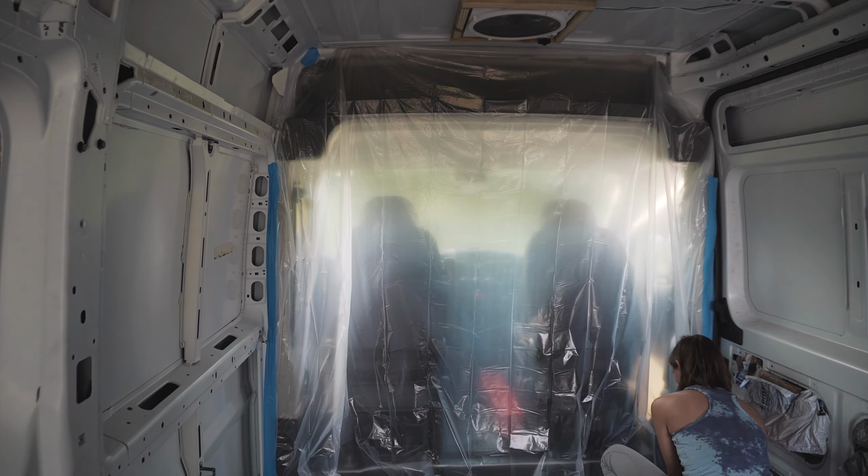Also, another thing to consider is these gases that come off while you're spraying. You need to be wearing a P100 level mask. We used a 3M, I think it's an acid gas mask. So you can pick these up for roughly $50 or $60 from Lowe's, but that is highly important. This is some very dangerous chemicals that you're messing with, so please do your own research on that and be safe about it. We gave ours up to 24 hours to cure and let any off gases out, so we left some windows cracked and some doors open, let all the gases and the weird smell evaporate, and honestly, after that, it didn't leave a weird odor or anything, and everything's super hard to the touch.